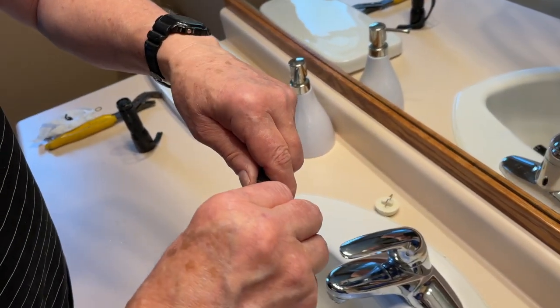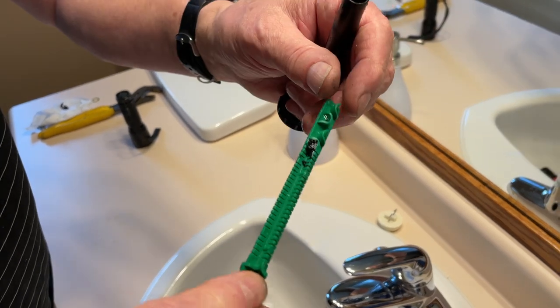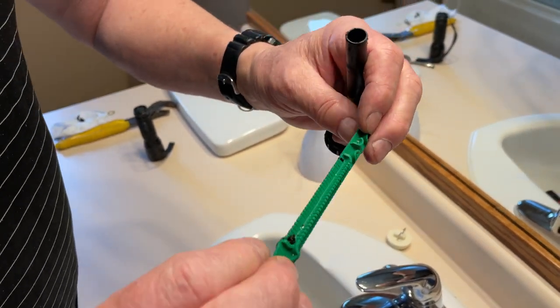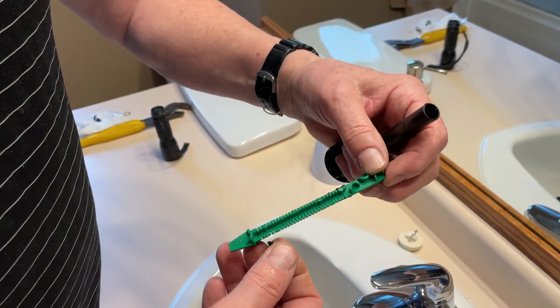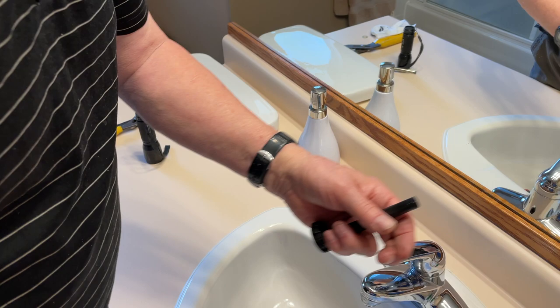The filter portion is this little green tube. Is there some black stuff on there? Look at that — there's your washer. That's disintegrated. That's the debris, and there's quite a substantial amount. That's been impeding the flow all along. That will definitely be the problem.